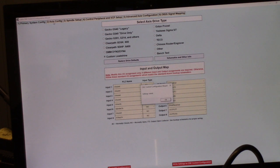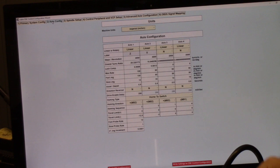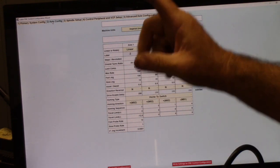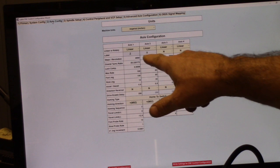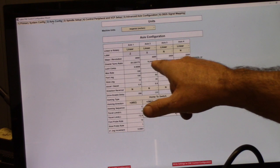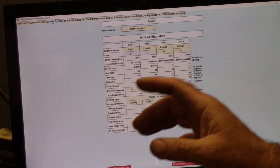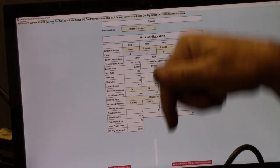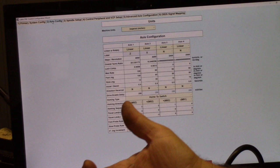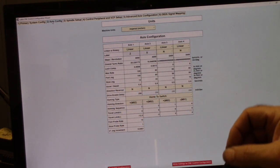Now I'll go to axis configuration. Right out of the box, those Automation Technologies drives have a 1,000 line encoder, and quadrature is 4,000. So steps per revolution is 4,000. Okay. Overall turns ratio, I've already fine-tuned this and verified it. There is a process for it. I will post a link in the description below. I've also done a video on setting that up. You can rough it in, and then you can fine-tune it with a dial indicator.